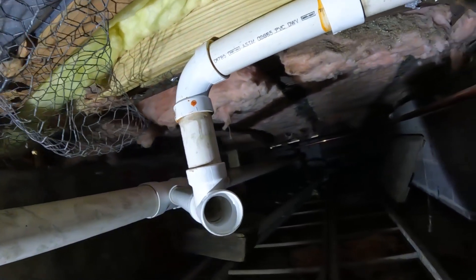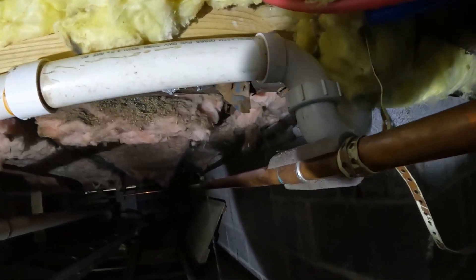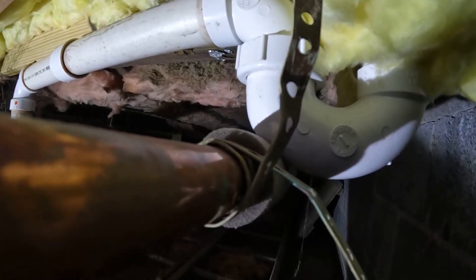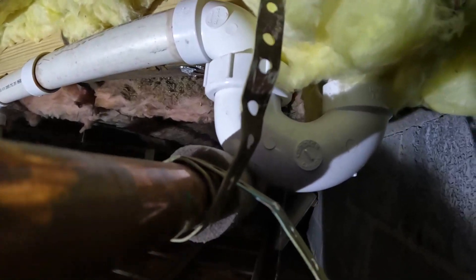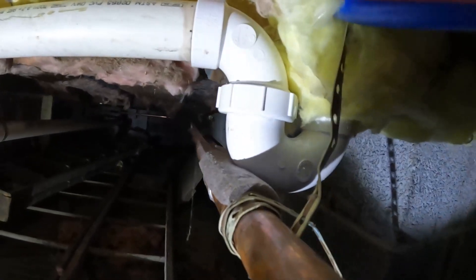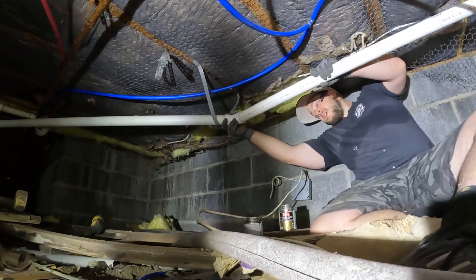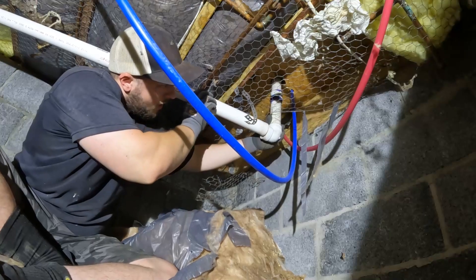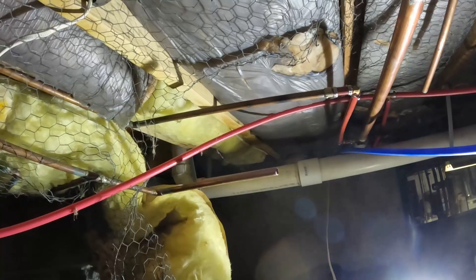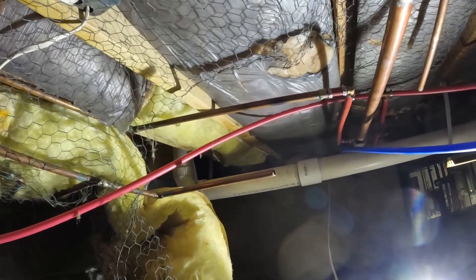That's it for the laundry machine. So you can see we've got that going in there. I put a little piece of pipe insulation between this boiler main and the PVC just in case, so it doesn't get too hot and maybe melt the PVC. I don't know if it would or not, but this will get pretty hot, so got a little piece of insulation there to be a buffer. It should be fine. Now the last piece is this big long one — it's going to go to the sink. So I can finally get out of this crawl space and go work above in the bathroom.